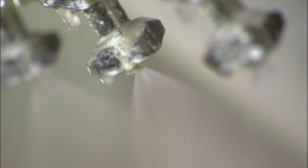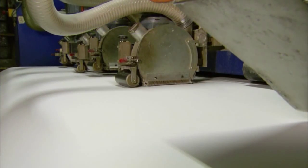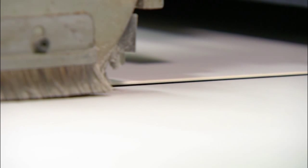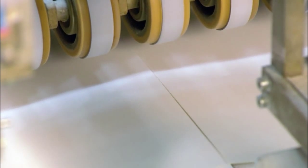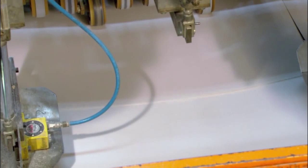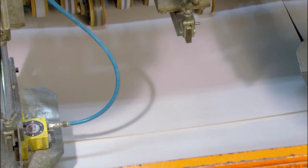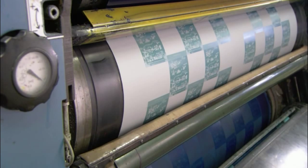Spigots apply a mix of wheat starch and water that acts as a glue between the layers. Off the mesh conveyors, the pulp board travels between cylinders that squeeze out the moisture, and more heated cylinders dry it. Knives then cut the board into large rectangles sized for the coaster printing and cutting machinery. This specialty cardboard is known as wood pulp board — it's lightweight yet highly absorbent. Next, it's over to the printing department.